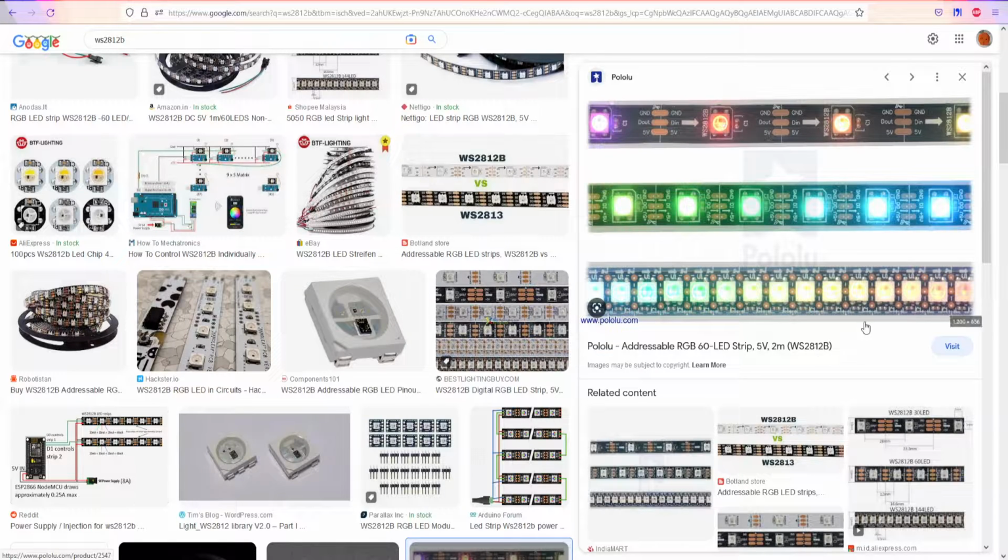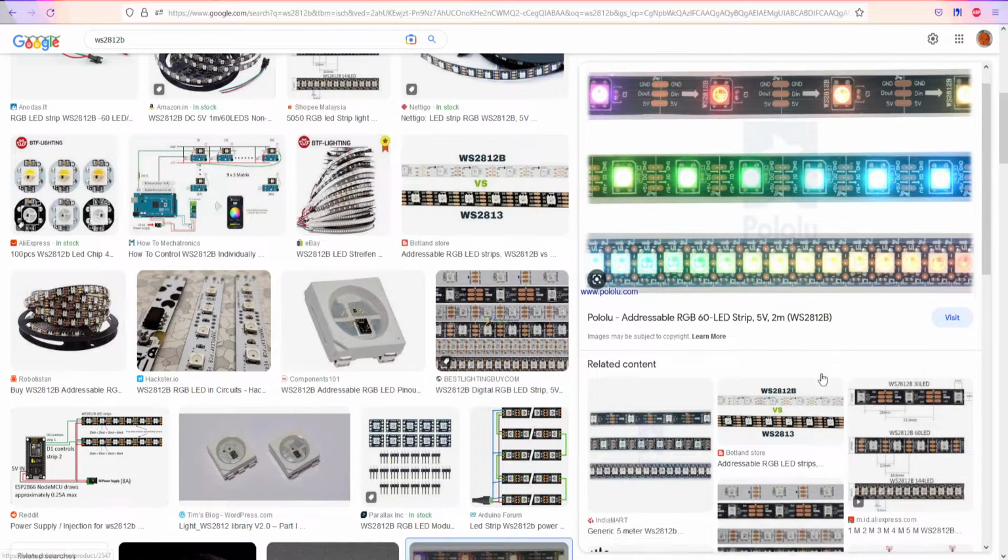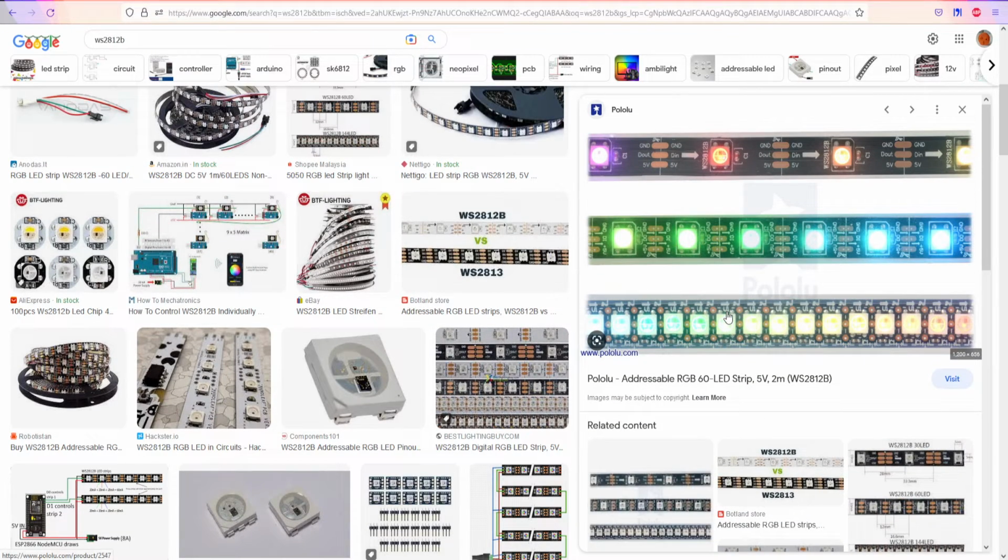And the problem with the spacing, you can have smaller spacing because the chip is really close to the RGB LED. Well, they could do it on the other side, but it's going to be more in the thickness, so it's going to be way thicker than the strip right now. So for small projects it's good, but you have to inject power.